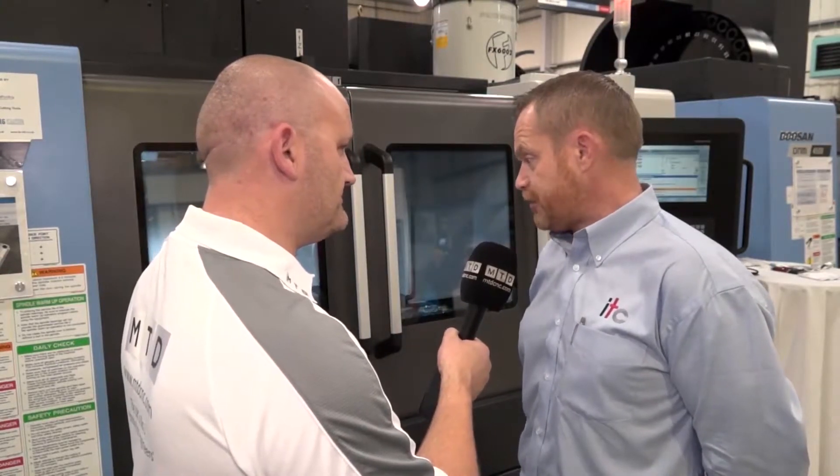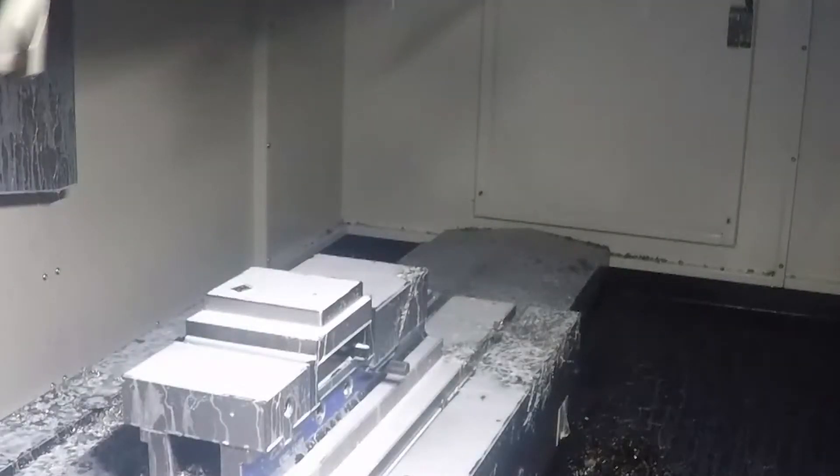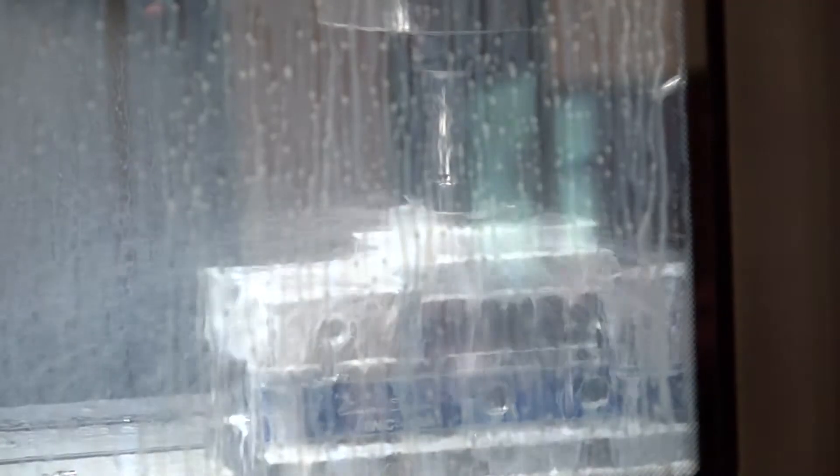And like you say, all on a 40-taper machine? Yeah, the 40-taper machine — the spindle of this machine is quite powerful, and then obviously to get the best of that, combining with the big Kaiser dual face and tapered contact tool holders giving greater rigidity, so you can use larger diameter tools with less vibration and giving more accuracy.